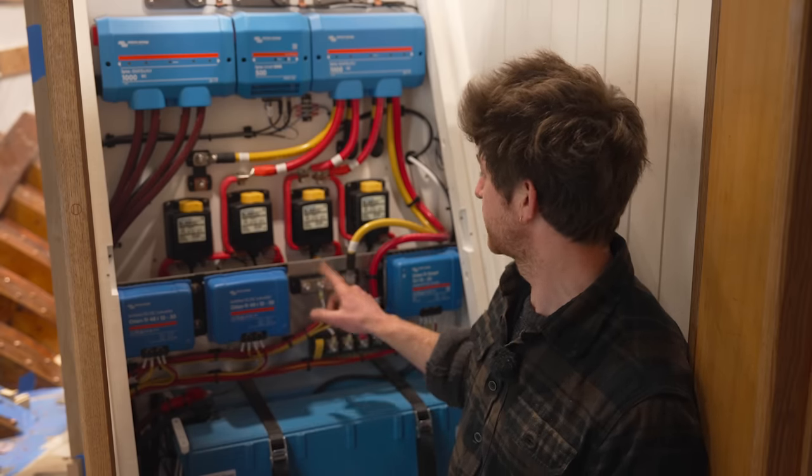Now we were talking about the hybrid system earlier, and one feature of that system is that the engine can be used as a standalone generator. But for that to happen, the shaft has to be disengaged from the gearbox, because the gearbox itself has to be in gear for the generators to turn. To engage and disengage the shaft, there's a device called a shaft clutch, which is attached to the gearbox and the prop shaft, and it's a series of kind of dogs which go in and out to turn one another.